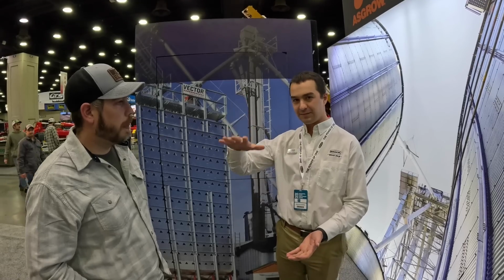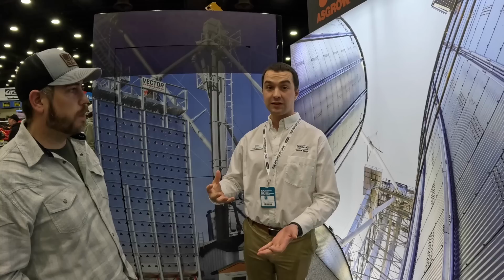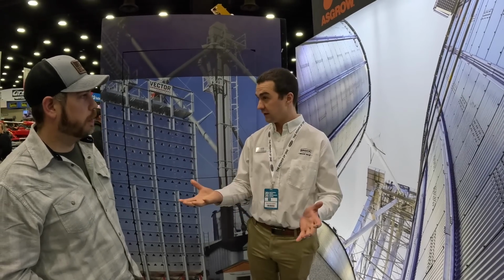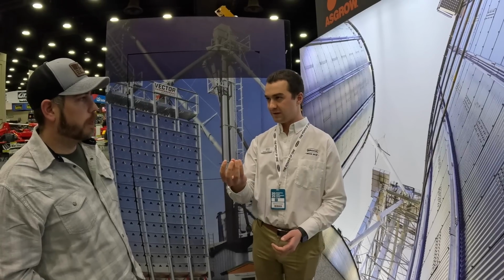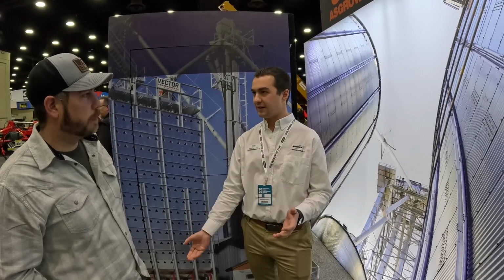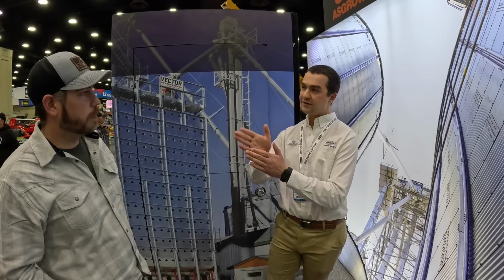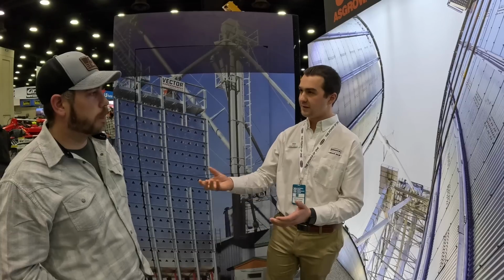Gravity does its beautiful work, and our dust, bees wings fall to the ground. So we were concerned about sucking in any type of foreign material. And then that gets into the fan, goes to the burner, now we have an ember. And that's not good in a grain dryer. We're trying to avoid that. So you might say, well, Grant, on your tower dryers, you guys have fans basically on the ground. Absolutely correct. But on there we have screens that it's sucking the air through, so we're really pre-filtering that air.